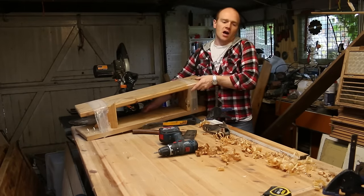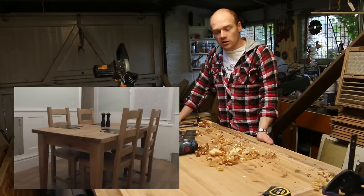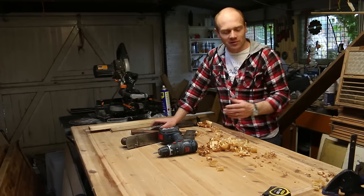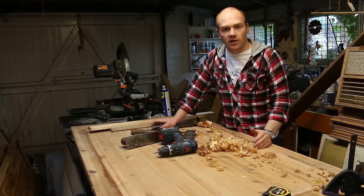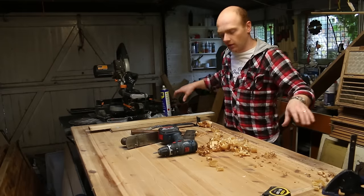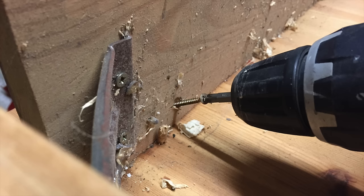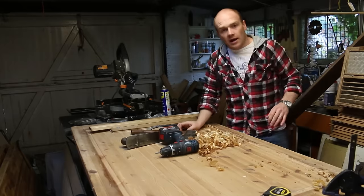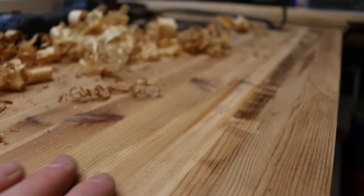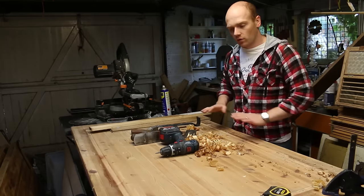I've finally managed to have a bit of a tidy up out here and uncover the workbench. I've actually flipped over the table top already. This is an old pine solid table top that we bought just after we got married, so it's nice to be able to reuse it again. I've actually got a bit of a thing for buying old tables — some of them are solid oak and some are pine like this, and they're perfect for ripping down into shelves. This one especially because it's full stave so there are no joins in the length of it. Last night I managed to get off the subframe which the legs would have attached to, and all that left me with was a little bit of clean up where they'd glued it to the underside. I ran a plane over that and took it down so it's nice and flat — we'll sand that, but we're going to see the underside of those shelves so I want to make sure it's nice and clean.